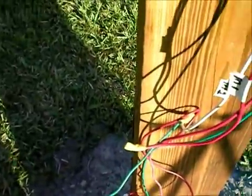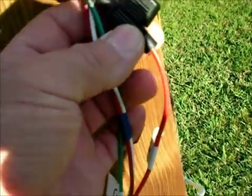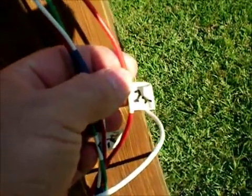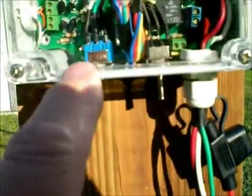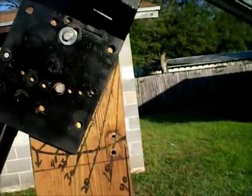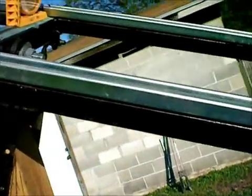These are going to ship out ready to go. All you've got to do is hook up your one wire M1 to the actuator, and wire M2 to the other actuator wire. I've already installed a 7.5-amp fuse in-line. There's your hot wire, your ground wire, M1, M2 — and I've got a clear cover so you can see everything going on. That little light says it's going to the west. This is the reincarnated very first solar tracker, back in action.